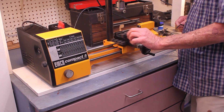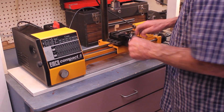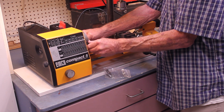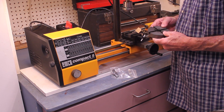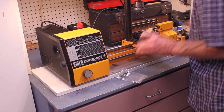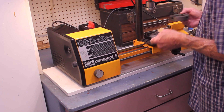There you have the possibility for milling on this lathe. There are all sorts of different things you can attach here. This thing here will attach to the lathe like so — it's a clamping plate, like a face plate, you can use on the lathe. That will also attach here if you want to, so you could clamp things to that. It might be more convenient for round things.